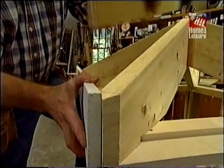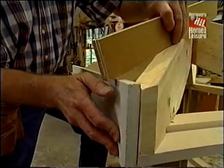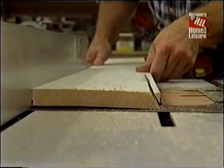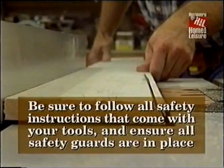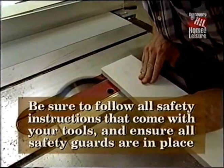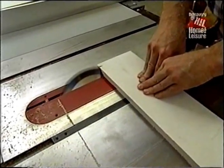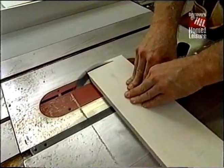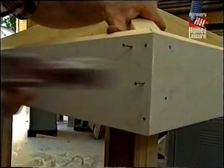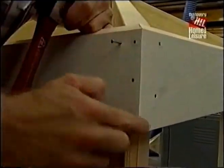Now the roof sheathing is going to be supported by the fascia board, and if I leave the top edge square, I'll only get support on the outer corner. A better way is to bevel the top at 30 1/4 degrees, the pitch of the roof. The fascia boards are a little too high to be cut in my miter box, but the table saw with the blade tipped to 45 degrees and a miter gauge are a suitable alternative. It doesn't hurt to put a little bit of caulk on these joints to seal them up.